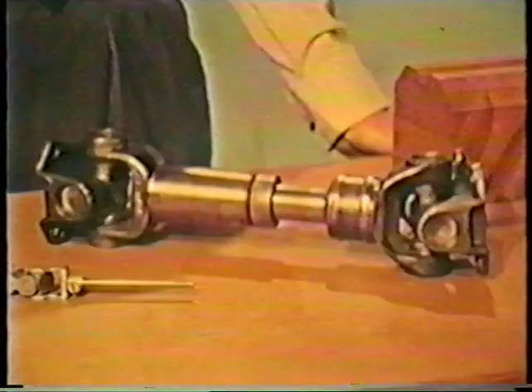I'm not just going to describe constant velocity shaft couplings, but to relate them to a new general theory which establishes the necessary and sufficient conditions that have to be met by any coupling designed to transmit drive exactly uniformly from one shaft to another.